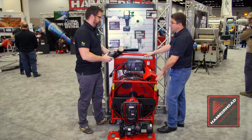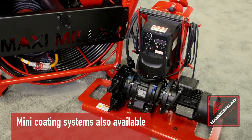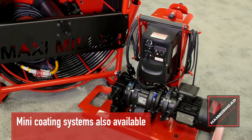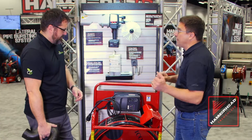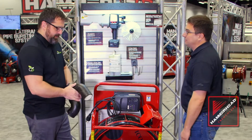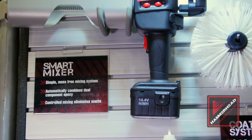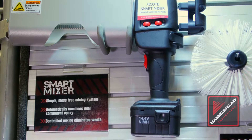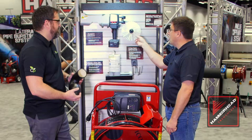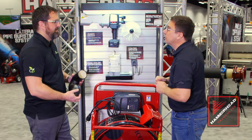That's exactly right. So we're going to take our Maxi Miller system with a brand new attachment — our Maxi coating, our Maxi pump — and attach it right on the top of that. We're going to use that to pump, and then our Miller's going to brush it on throughout the pipe that we just cleaned. And with that we also have our smart mixing unit, so we can get an exact mix every time with our dual component and our smart mixer with our brushes that keep our system in the middle of the pipe as we coat it.